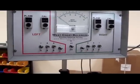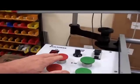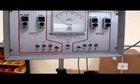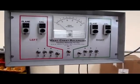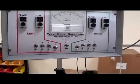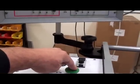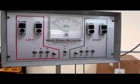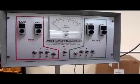So we're going to see if it is. First thing we want to do is press the left top button and take a look at the meter. You can see it is very low. This part appears to have no unbalance in it on the left correction plane. Now we're going to check the right side — press down on the right side button and see if we get any kind of reading. It appears as if there is very little imbalance in this part. Stop the motor.